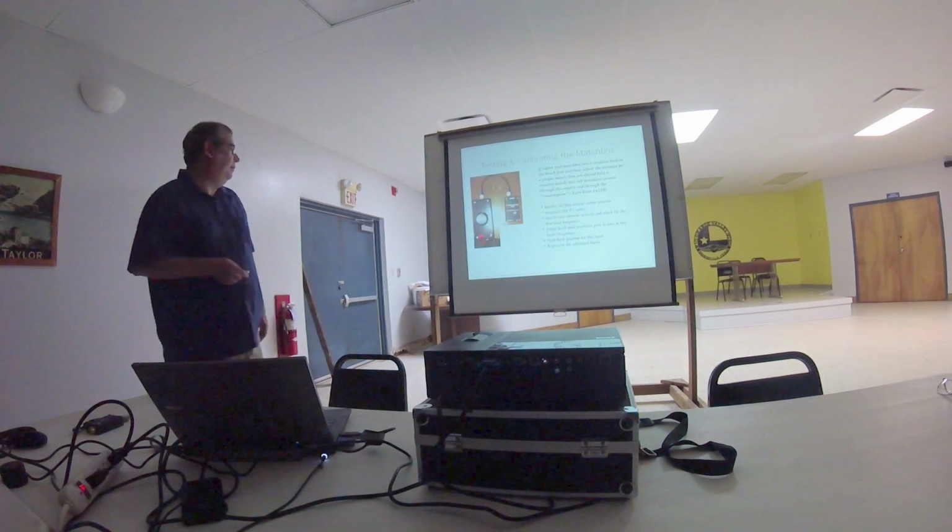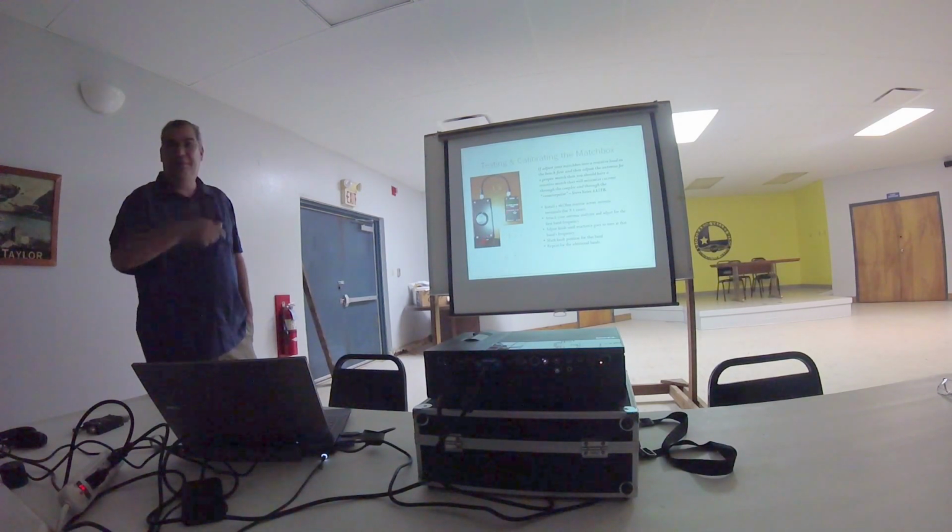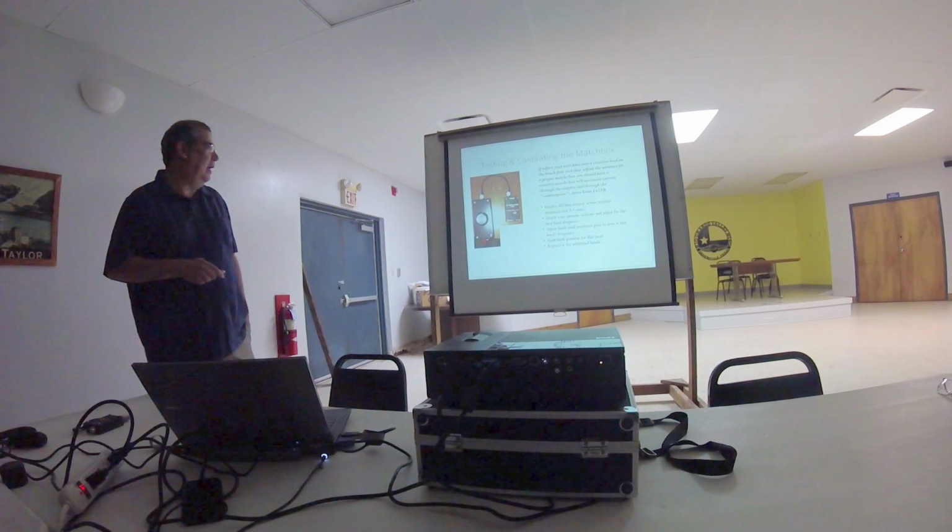This is the finished unit, and I'm actually testing it here. This quote by Steve Yates is really a key here. To get maximum success out of one of these antennas, he recommends basically putting a resistor across the terminals and finding the resonant point on the capacitor that way. So if you look here, essentially I've got a 4 k ohm resistor, which that spreadsheet gave me the value I needed for.